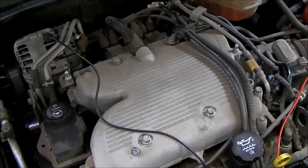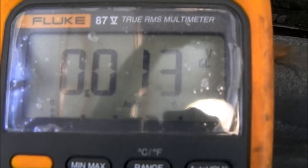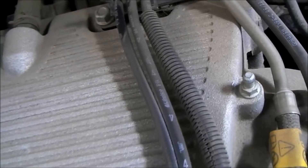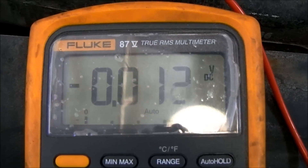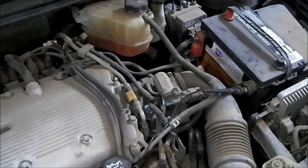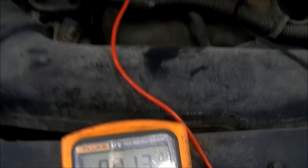You can practice this on just about any car. It doesn't matter too much honestly where you put which color lead. You can see right here we have 0.13 to 0.14. If I accidentally put these leads on wrong and swap them around - putting the negative lead on one side and the positive lead on the other - we'll get pretty much the same reading. The only difference is now we have a negative sign. So the only thing that results from getting the leads hooked up backwards is a negative sign - you still get the same reading. The color or polarity of the leads doesn't matter as long as you just remember to ignore that negative sign.